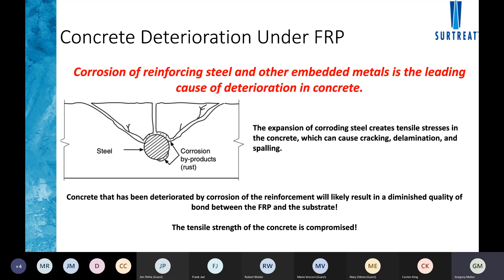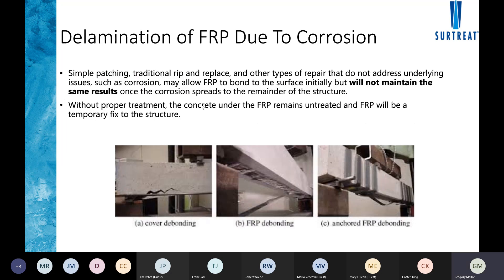Standard concrete deterioration and surface spalls are all activated by water and oxygen infiltrating to the rebar. The rebar then swells, causing delamination and micro-cracking. The big issue is if concrete beams have been reinforced with fiber and corrosion is happening behind the fiber — you then have to remove that fiber, repair the concrete, and re-wrap with fiber. It becomes extremely costly if that corrosion wasn't addressed prior to the fiber being installed.